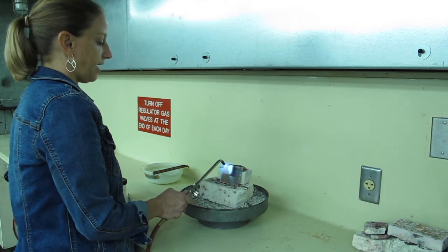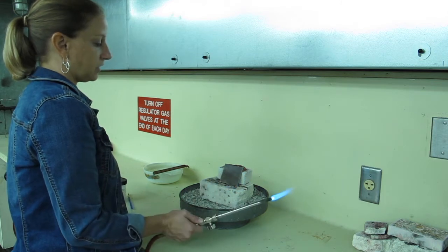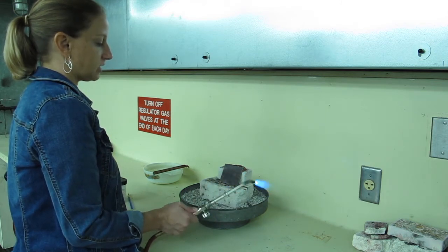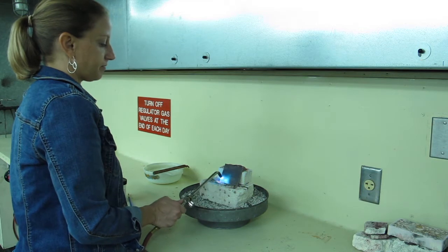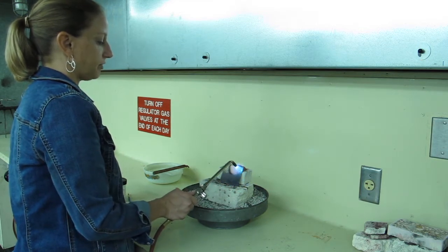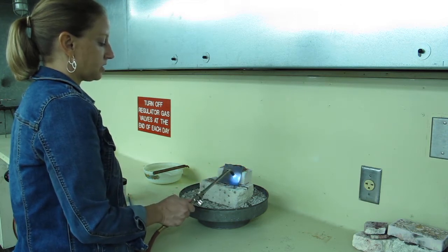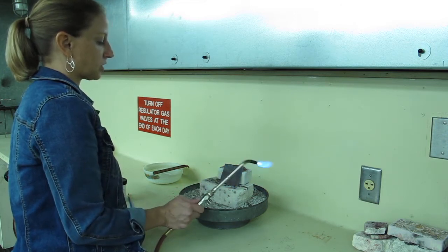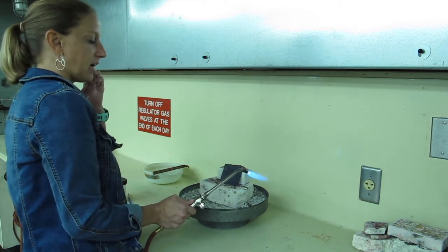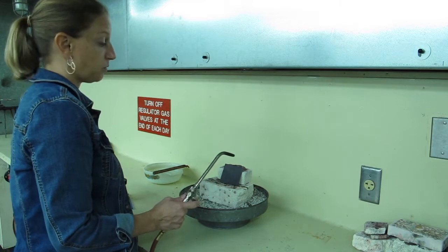After I start to get through the metal again, all of the metal becomes a dark gray — all consistent. That's the next stage. Then I'm going to be looking for when the flame coming off of it is turning orange, just like you see there. When it's turning orange, and even when my torch goes across and I can see that it's pink behind it — that has been annealed. So that's one way.